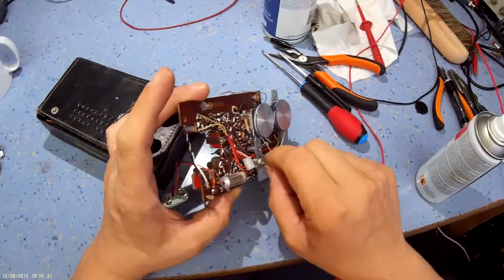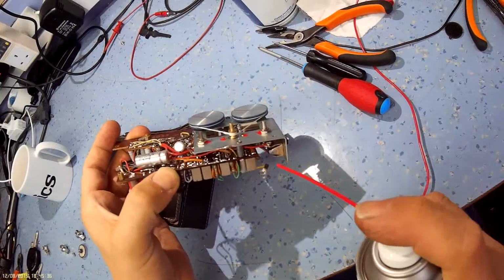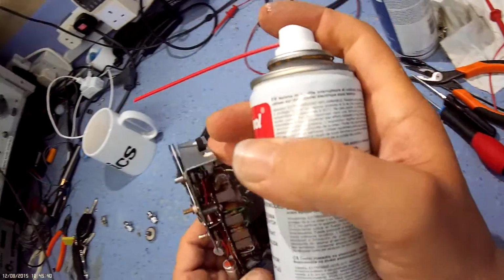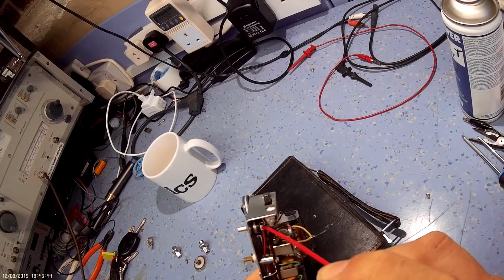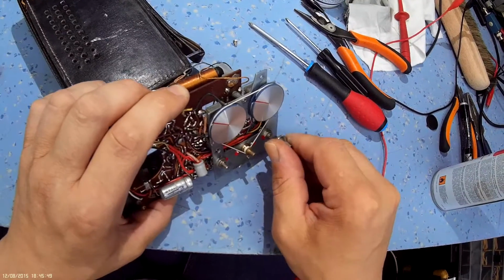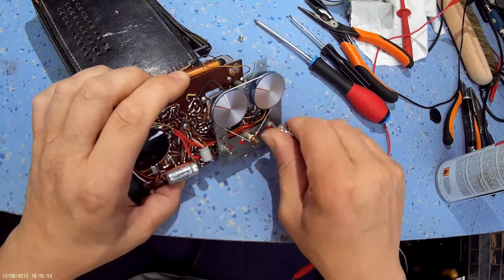You see these lugs are broken off here. That's the lug on the chassis. Where's the other one? Just here. This is the volume pot that I tried just now. Don't think I got any contact cleaner in there really. Put that on there and give it a work. The click's nice now. It actually sounds like it's turning off properly.